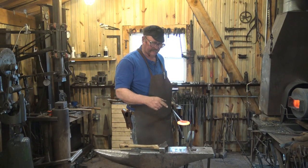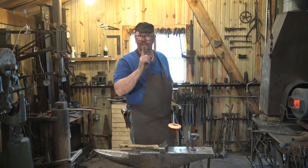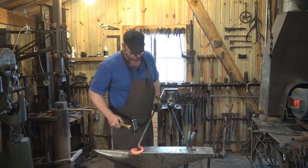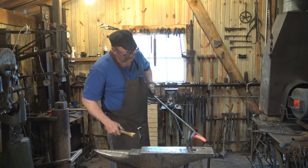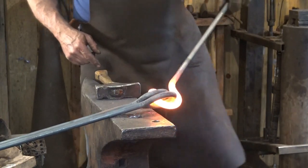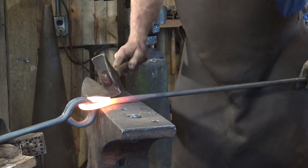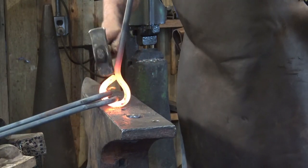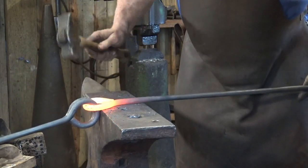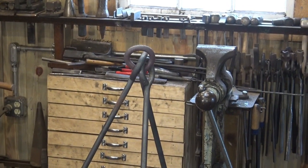We have our three rings — now it's just a matter of linking this ring with the other two. Maybe it's easier said than done... or is it? Just offset the end enough that you can get it through, then bring it up to heat, link the first two bars in, bring it up to the handle, clean that ring up. You can't get it back into a form very easily, but if you've done everything right you shouldn't need to. Try to round it up as best you can — and now we have a tripod that is all connected and ready to go over a campfire.